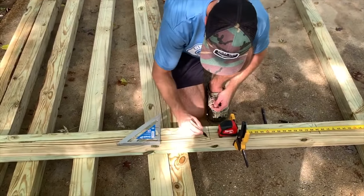So a successful LP smart siding installation starts with planning. In this case, we framed our wall so that the total height, once the bottom was positioned on our ledger board, would land directly in the center of the double top plate at the top.